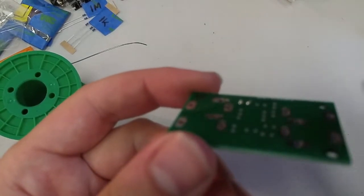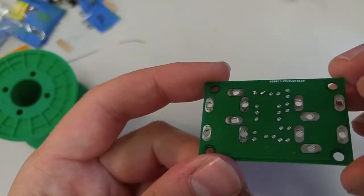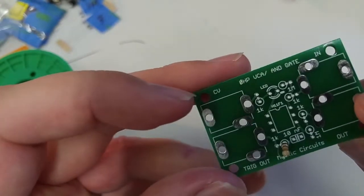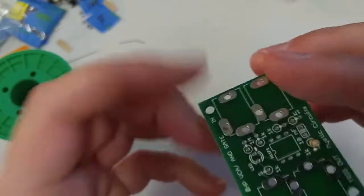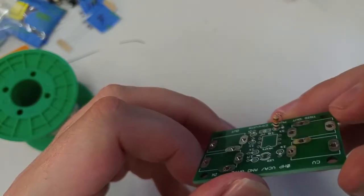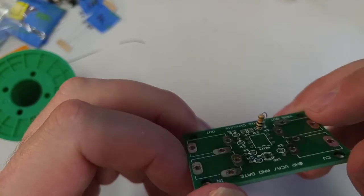and if we take a look at the joint, we'll see this nice Hershey's Kiss of solder sticking out. Look at the other side. You can see that the solder went all the way through the hole, making a nice bond with the leg of the resistor. You can even see a little tiny bit of solder underneath there.